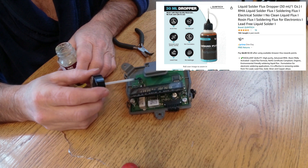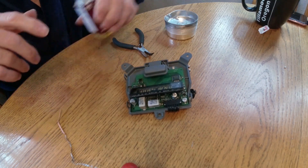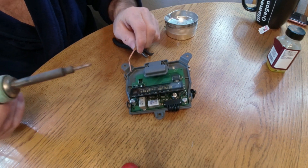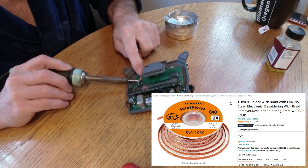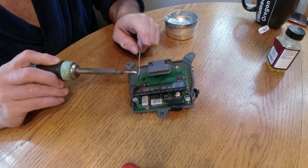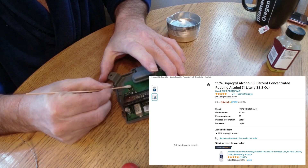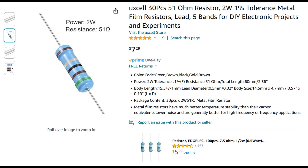So the first thing I'm going to do is remove that crappy solder that the original vendor used — it shouldn't have gotten hot enough to melt. Can you say lowest bidder? The tool for this is your soldering iron and something called soldering braid. After you apply a little flux to the solder, put the braid on top of it, then the soldering iron on top of that, and the solder will melt off the circuit board and be wicked into the braid. I then use 99% isopropyl alcohol to clean the entire area up. Since the design obviously produces a tremendous amount of heat, I'm not putting the original small resistor back on.